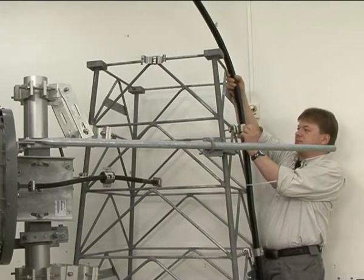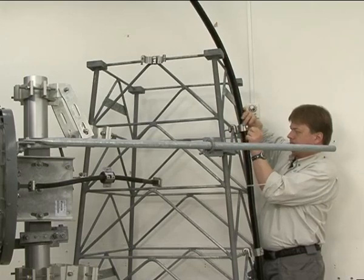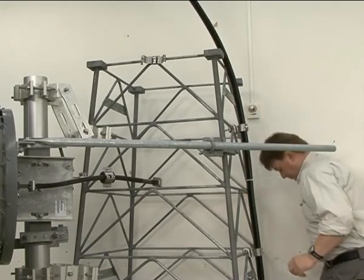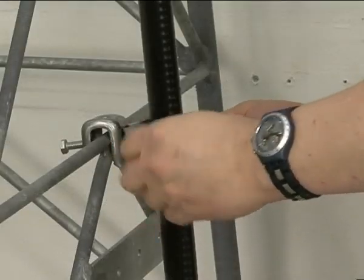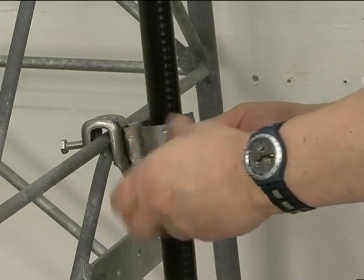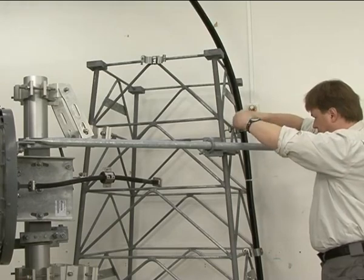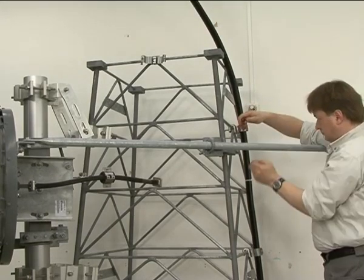Close the clamps over the waveguide. Note that you can remove the hoisting grip from the waveguide only if it is attached with more than ten clamps. Tighten all clamps with a screwdriver. It's important to support the waveguide along its route to the flexible waveguide as soon as possible.